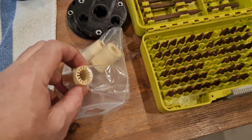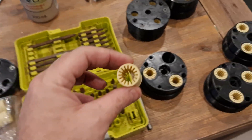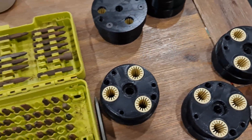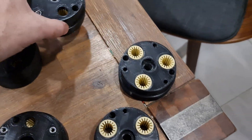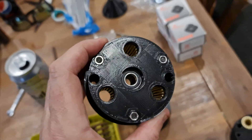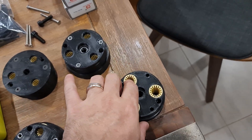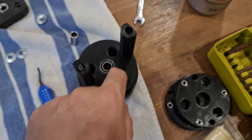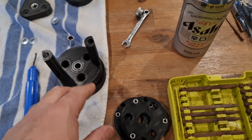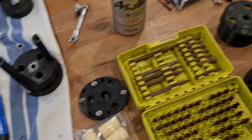That's going to give me an extra 60-70mm of travel. I've also got these igus LMU U12s — igus instead of roller bearings — so they'll go in like so, then we bolt a cap on top and that's the new design. Hopefully there's less friction on these bearings because I'm not sure if it was just sideways load making them squeak, but this will give me the extra range.